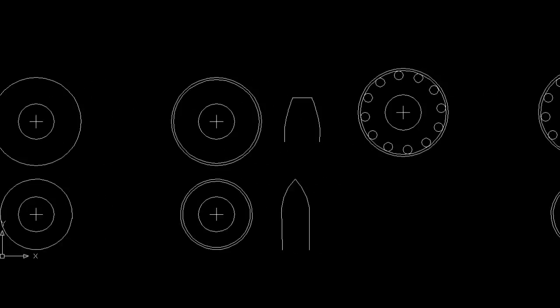The next move is the same on both of them too. On the circumference of the gear blank, you're going to create the form that you're going to be making. With Robert Porter's method, I was making cycloidal gears, so we're going to be cutting a form that would be able to cut this onto the gear. With the Eureka tool, I'm going to be doing an involute gear form, and so that would be cut on the side here to cut an involute form similar to that.